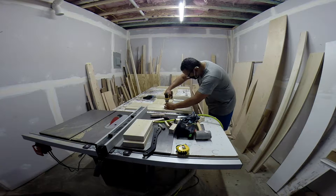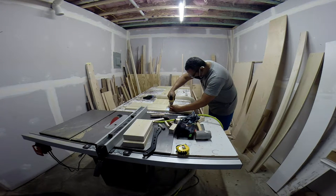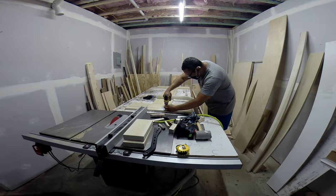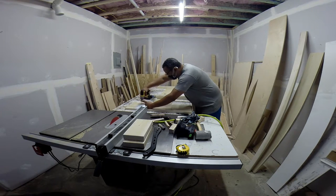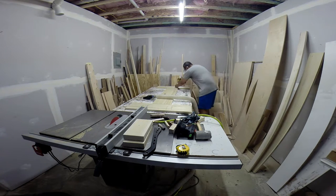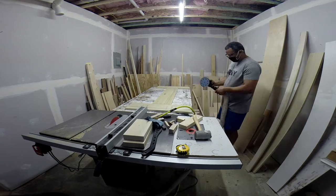I had already connected these pieces together and cleaned up the edges. This is the very top of the base — this is how the table gets connected to the actual base. Some time was taken to make sure that all the tops of the arches lined up, and you can see the drawings on those. I'm just drilling into the top of this so when I stain and sand it, I won't lose that positioning.